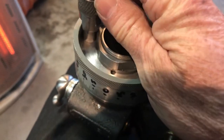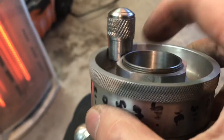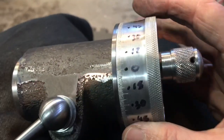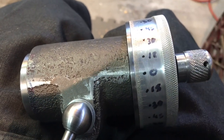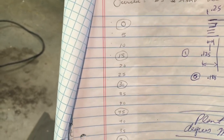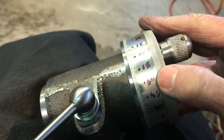One thing that Dan didn't have in his revised drawings — I did have to mill a little notch on the back side of the plunger to clear the nut, so you may have to do that too. It was no big deal; I just marked it out and milled it a couple weeks ago. Now that I've got the fitting done, I'm getting ready to mark out and stamp the numbers. The drawings from the Quorn groups call for marking using 0, 15, 30, 45, 30, 15, 0 in quadrants — and that's what I've got marked out here with a Sharpie.